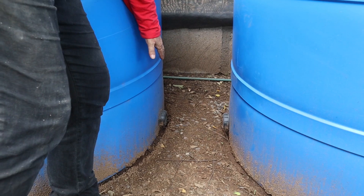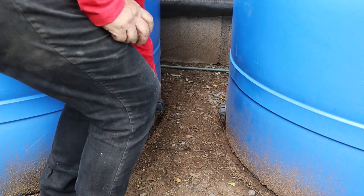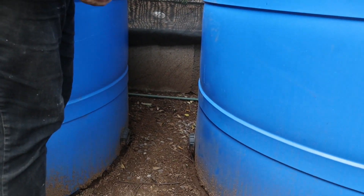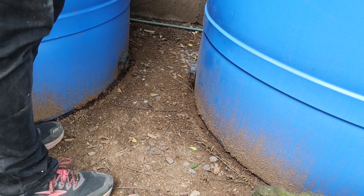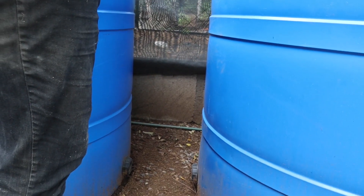Here are the two connectors, and they're the reason why we had to go back to the hardware store this morning. I had measured these, and if you measure from the outside, it's two inches, so I thought I needed two-inch PVC with threads. It turns out they don't measure it that way — you measure the inside diameter. This is one and a half inches, so this fits in there fine.